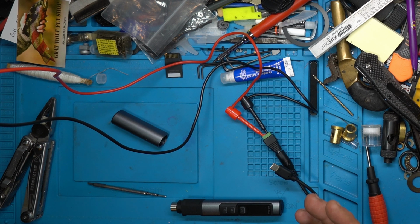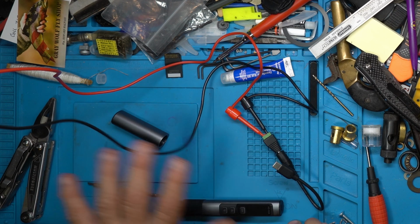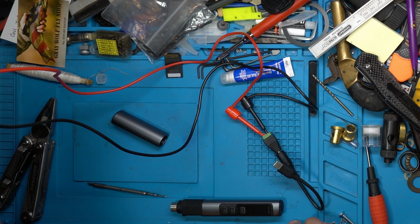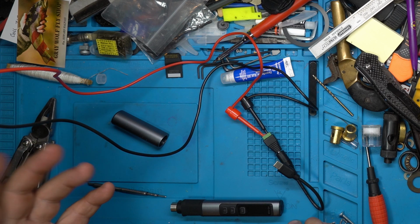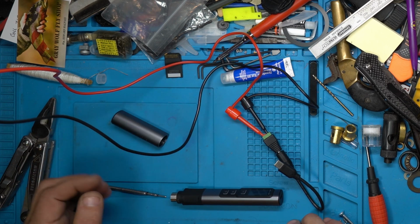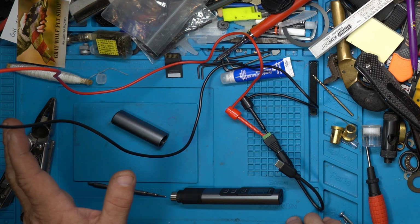And again, my overcurrent was set at 3 amps, and my amperage on 20 volts was set at 2.95 amps. And for anybody that doesn't understand how some of that works, I set the amperage at 2.95 amps, but whatever you're starting is only going to draw what it draws. If it draws 1 amp, then I'm going to see 1 amp drawn on the power supply, even though I have it set at 2.95. It's not going to just supply 2.95 because I have it set there. It will supply up to 2.95. And then if it exceeds 3 amps, it'll trip out, and the protection will kick in